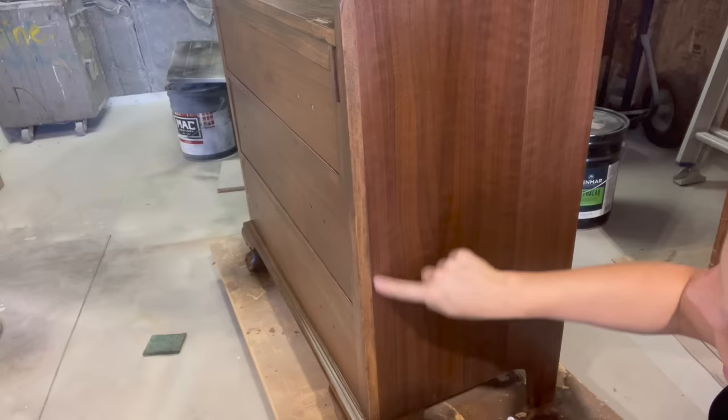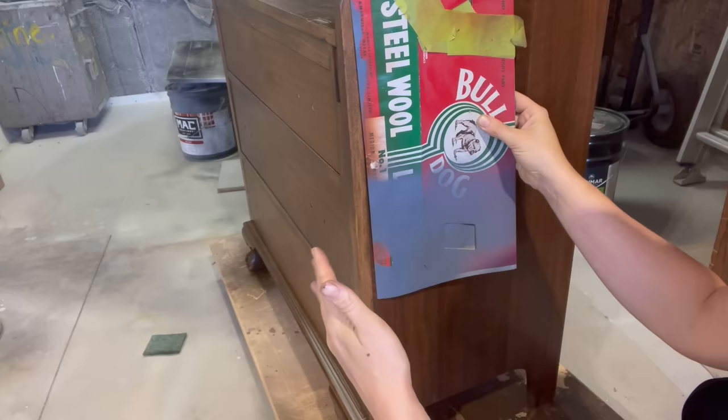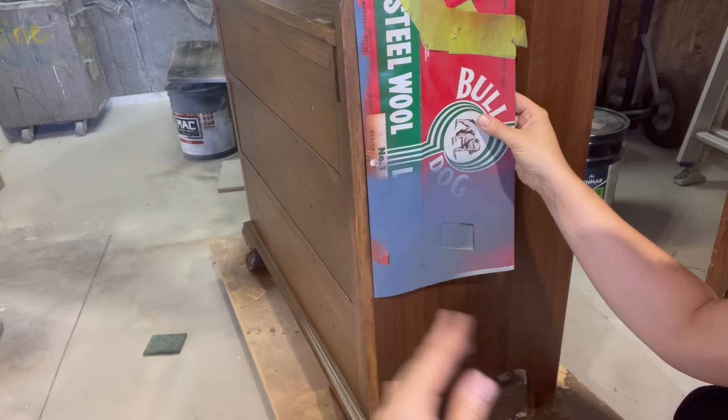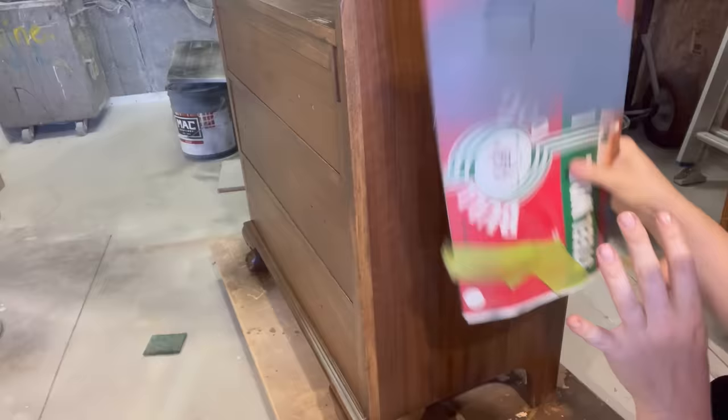Okay, so on the side of the cabinet, they have this poplar piece, which is the front face frame. So I don't want a hard line, even though this is a hard line, to do my tint work with. So what I'm gonna do first is use a paper that doesn't really sit close. When you're spraying it, a few particles of the toner will float over to the other side. That's gonna help blend. If you do a straight hard line, you're gonna get a very distinct color change from here to here, and that's not exactly what I'm looking for.